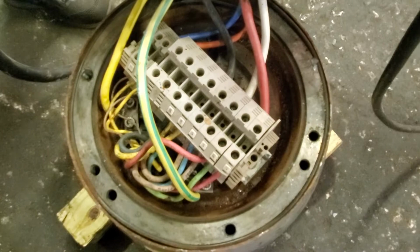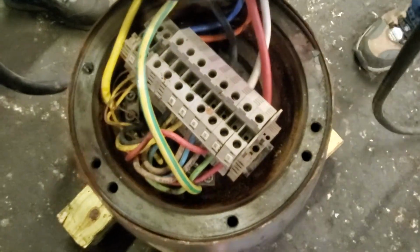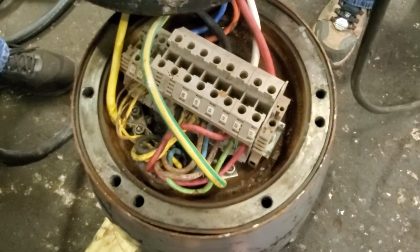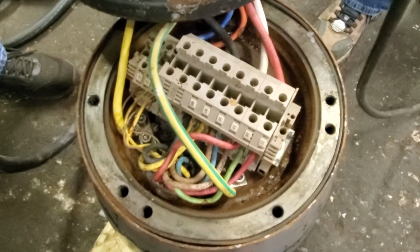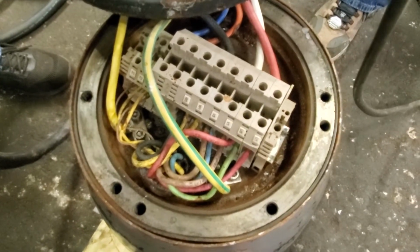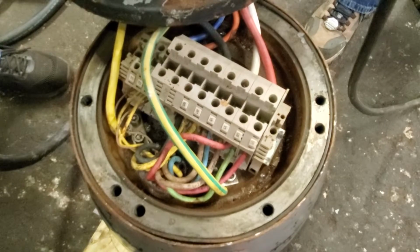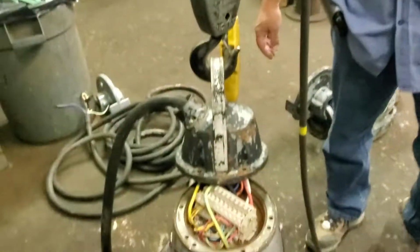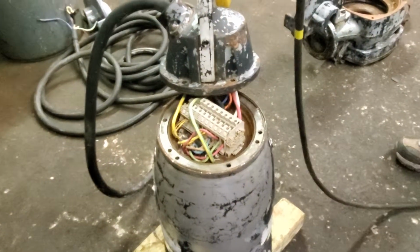So there's evidence that this top junction area was hot. Yeah, good hot. You see on the right here, corrosion right here. That means it got hot. And so there was probably no liquid, no water, glycol propylene mixture, antifreeze in the pump, the cooling jacket. So you think the pump got too hot based on no water in the cooling jacket?